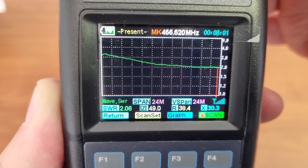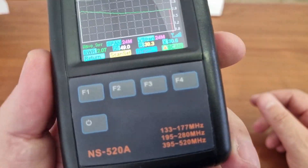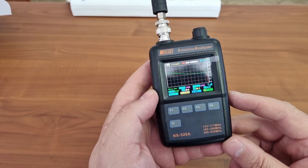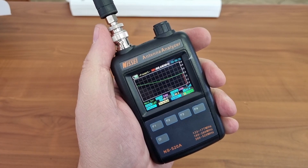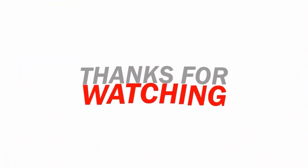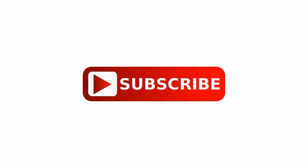You'll be able to see the impedance at the bottom as well in the actual resistance. As we get closer to 460 MHz, you'll see the impedance get closer to 50 ohms, which is what we want it to be. Well, there you go guys — that's about my bit on this device. Thank you for watching. If there are any questions you want to ask me regarding this or anything else, make sure to send a comment. This is a brilliant little device. Thank you for watching another great review from Acecoms. Please like, subscribe and share our videos. Also feel free to send a comment, request for a review, or just a shout out. Stay safe till next time.